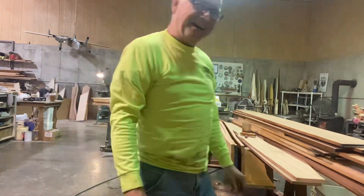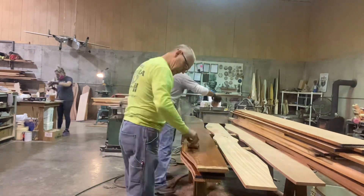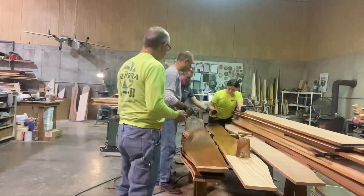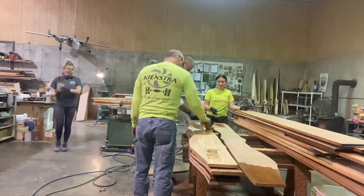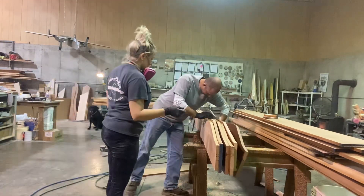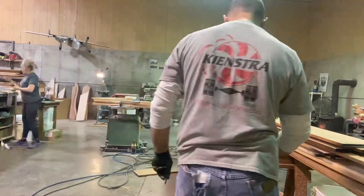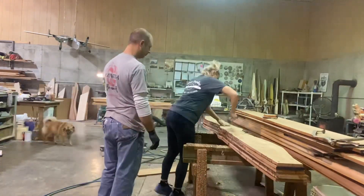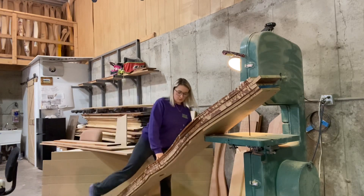This is going to be a 98-inch propeller, but I made the blank a little bigger to have the option of making a hundred-inch propeller in the future — also the maximum our press could hold. The widest point of this blade is eight and three-quarter inches wide, and I always give myself extra room to work with, which was also as wide as our press would take. We made it out of mahogany so it wasn't as heavy. We pinned the ends with dowel rods, then it went straight into the press for 14 hours at about 75 degrees and 90 psi, since there were so many laminations.